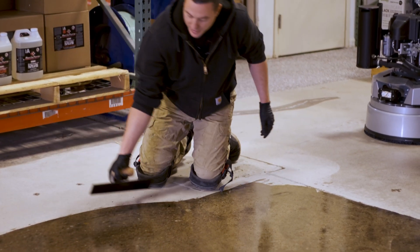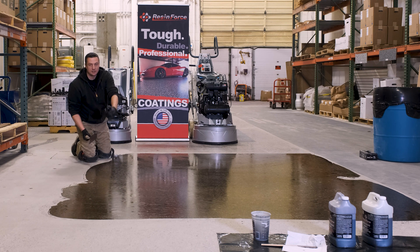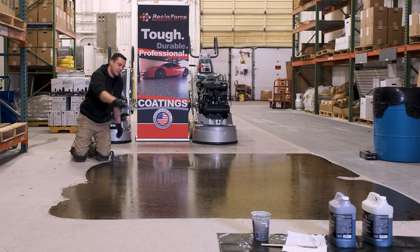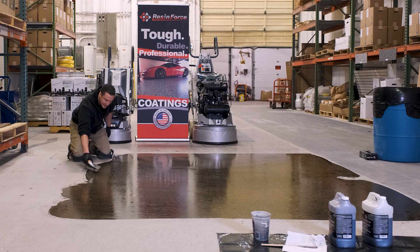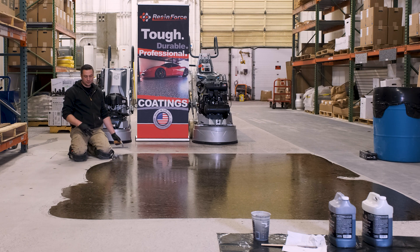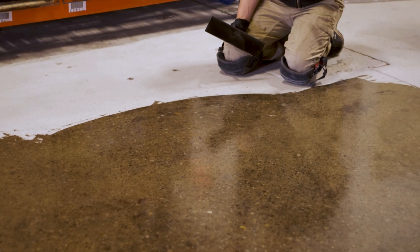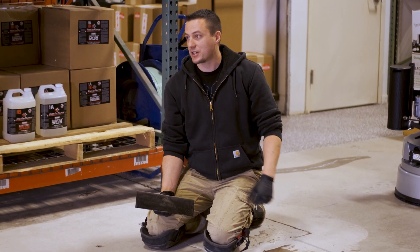Back, forth, overlap — using a sweeping motion to always keep a wet edge. If I have a bead in front of me I can just come back and grab that. If I'm not pushing down enough or I get the wrong angle, I can come back over and pull it tighter. As long as you're pulling it tight and coming across the floor, it's completely wetted out and you get rid of all your little divots. If you have little pools or thicker dark spots all over your floor from not pushing down enough or not scraping it tight enough, and you're doing polished concrete, it's going to make your next step grinding a little more tough — you may have to make two passes. But as long as you keep it nice and tight, your next step goes really quick.